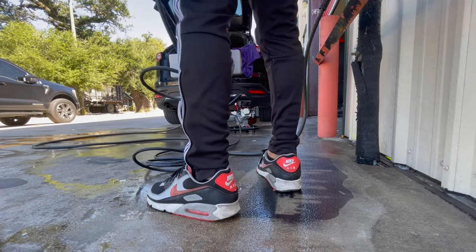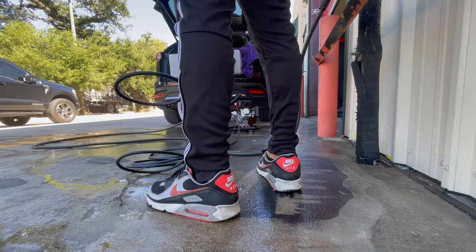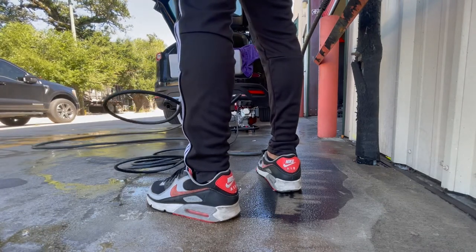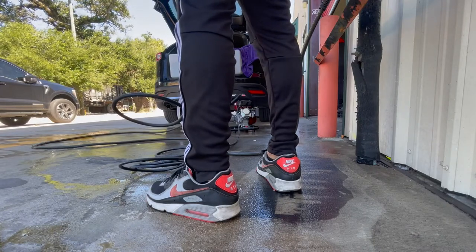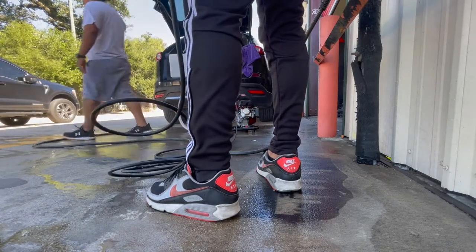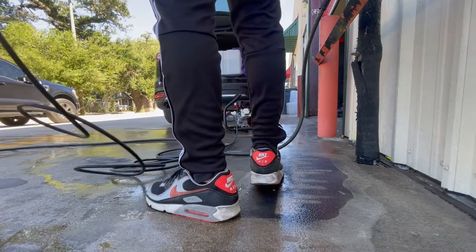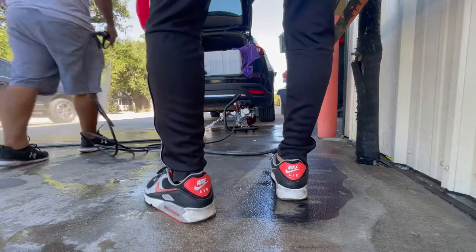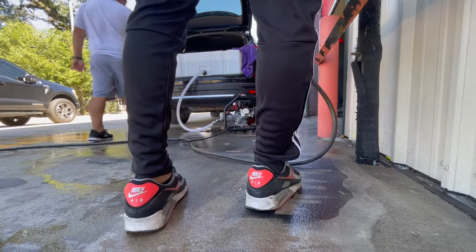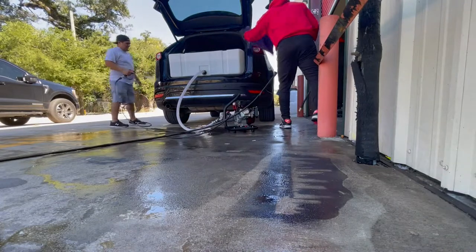Typically you're going to want to do this on any new pressure washer setup that hasn't been primed for you. This helps get all the air gaps out of the pump and hose, and helps the gravity feed system work better. A lot of guys set up and don't do this and think their pump is incapable. There are some cheaper pumps with really strong springs that won't allow water in because the pressure isn't good enough to push them open on a gravity fed system. But as you can see, this one had no issues with that.